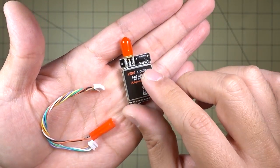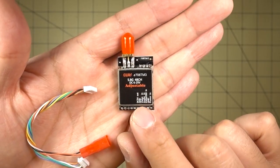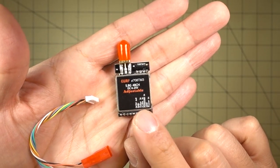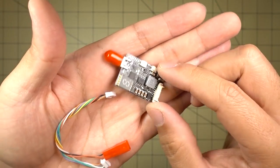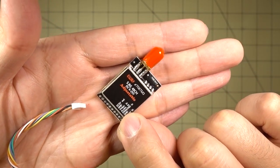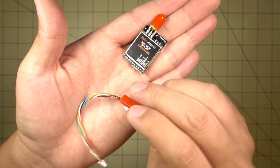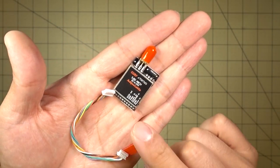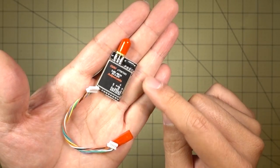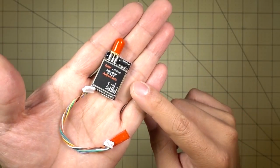We got another video transmitter — here's a full-size VTX from EWRF. It's power switchable; I think it goes from zero up to 600 milliwatts. This one lets you use the smart audio protocol to make power changes, band changes, and channel changes via your Betaflight OSD. On this side you can see you've got your 5V out, ground, video in, audio in, and then PWM, OSD in, ground, and power — all corresponding to the included connector, plus a little JST for your power input. I'll have a review on this one. I also have the miniature version for micro-sized builds with the whip antenna already installed. We'll hook this up to a flight controller with the Betaflight OSD and show how it operates.